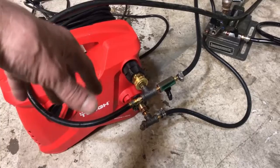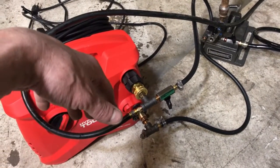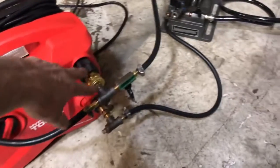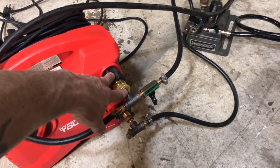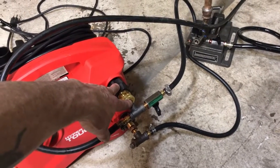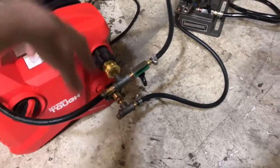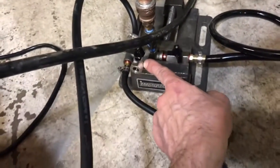In a matter of hours. So to make this thing a 100% duty cycle and to be industrial, we have to remove all the filters. And that's one of the good things about the waste oil burner nozzles that I have — they allow up to 3mm particles to pass through the nozzles. Unless you're running on a very low setting, then the valve aperture is too small for that.